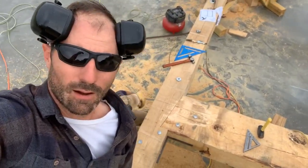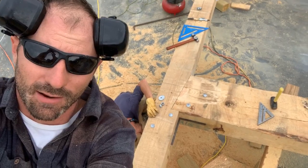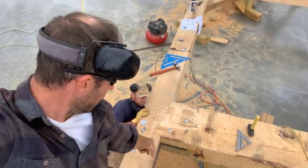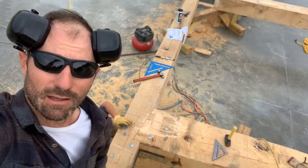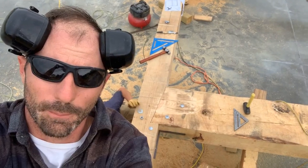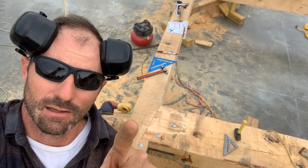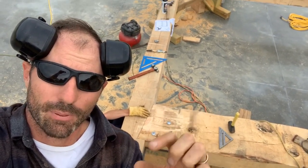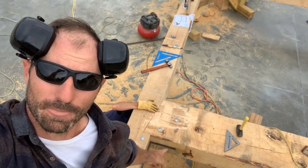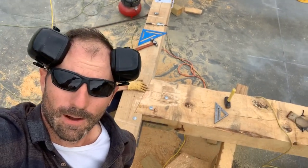Another thing about this joinery — we don't want to completely rely on the steel connection alone to hold our beam. So we've created a three-inch ledge: we cut kind of a half-dovetail three-inch ledge right there and tapered it to nothing on the post. If we cut a square notch, the beam could expand once it sits out in open air and gains some moisture, and it could crack that post. By cutting a miter on this 10 by 18, if it expands it just goes into open air and doesn't bind on that post.